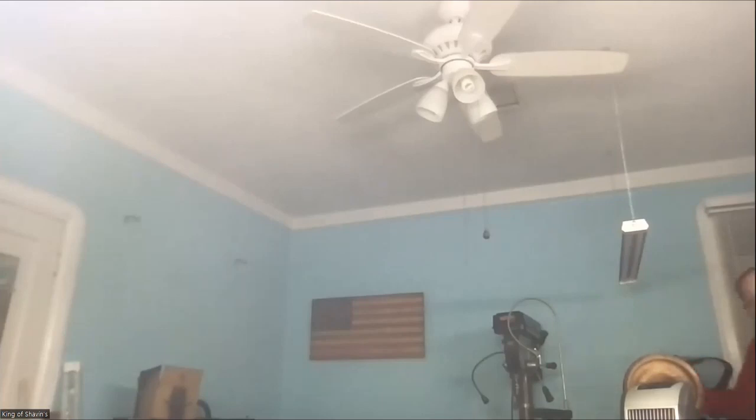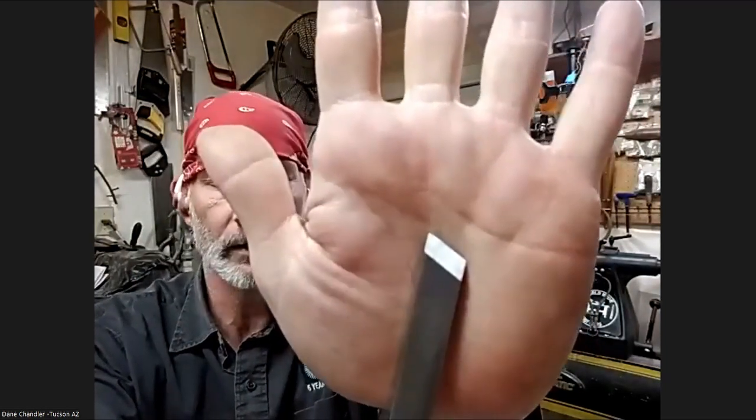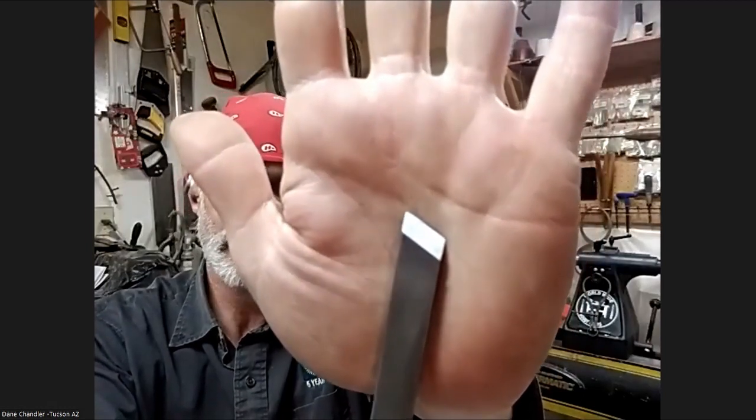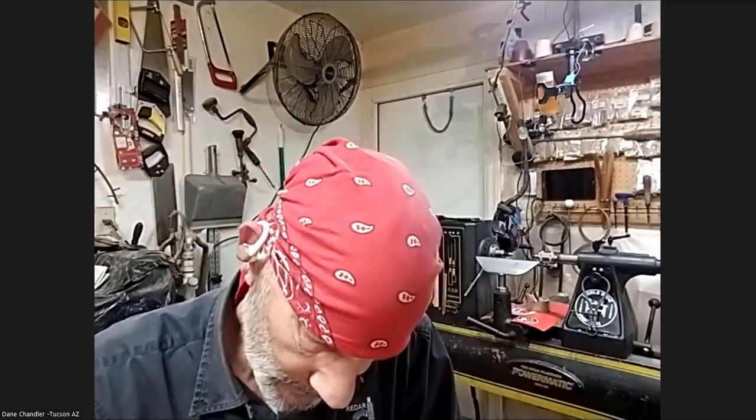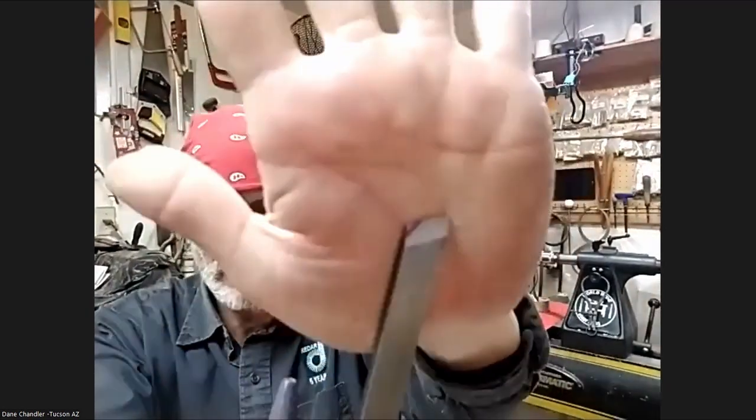I have it. All righty. So this would be rudimentary. I do have the straightforward, typical skewed grind. From this point here, what I do is, for that corner, one-third of it, I've got it designated there with the marker, I would take that straight in against the grinder, flat, and remove that excess material.